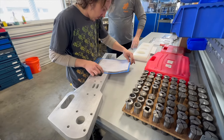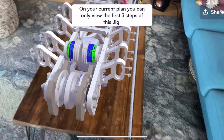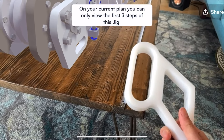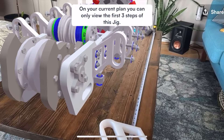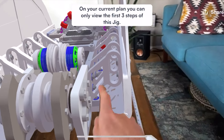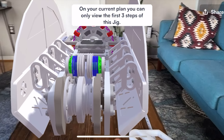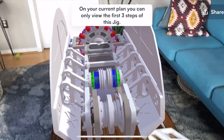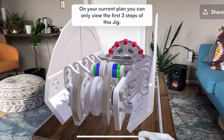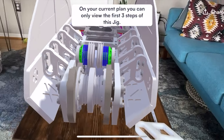The aluminum frame is then flanked by these plastic ribs — UHMW ribs that bolt on. We kind of call this the 'dead fish.' These things are really hard, but they become quite compliant when hit with the force of a BattleBot, so they almost form springs. When we are hit, the shell will deflect a little bit, and all these UHMW ribs form a spring between the shell and our aluminum frame. The whole robot itself is really only about 10 inches wide and all aluminum, and then the armor is this spring UHMW system that is going to take quite a bit to punch through. You can go 6 inches into this and not hit any of our valuable electronics or motors.